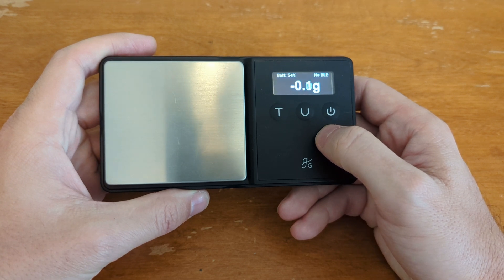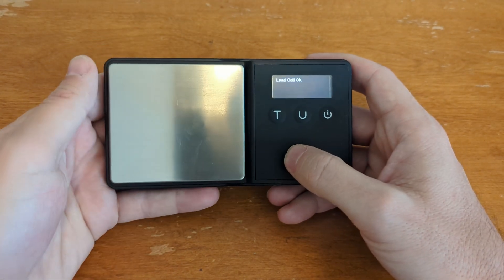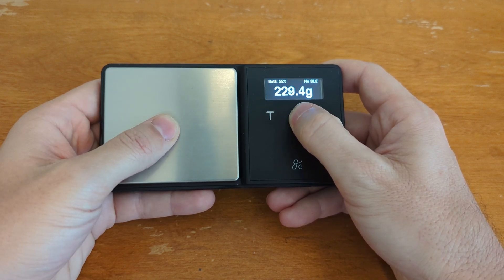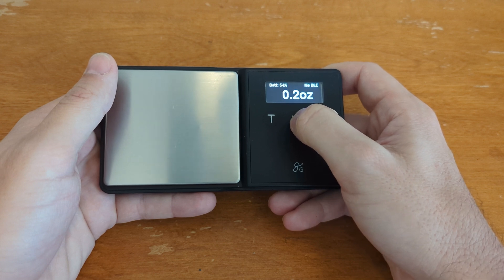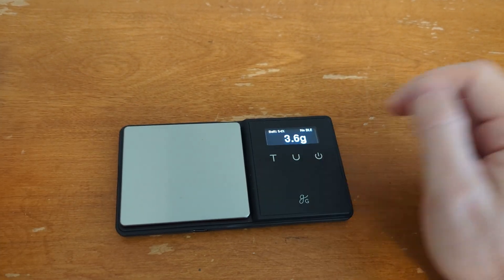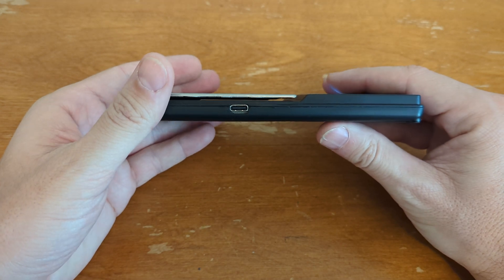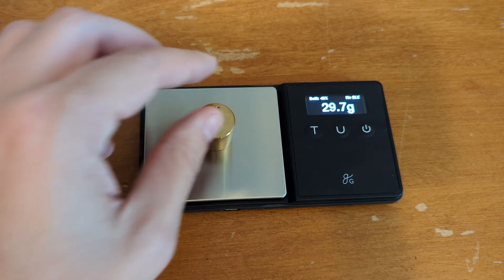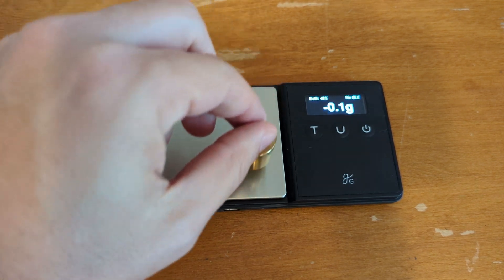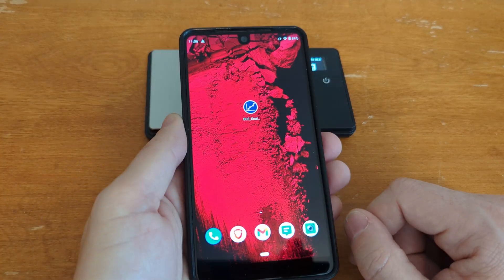The power button is now wired to trigger deep sleep and bring the unit back up — there's a little boot time but no problem. I've wired the units to toggle between grams and ounces with a heavy debounce so you have to push it deliberately. There's the tare function which works as expected, and I've got a battery percentage indicator at the top along with a BLE connection indicator. Because this uses the original mounts in a much better design, the scale is pretty accurate no matter where you put the weight once calibrated.